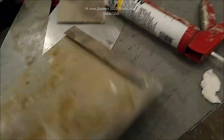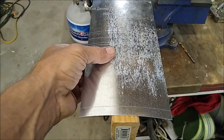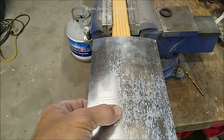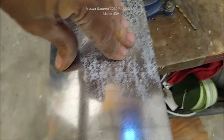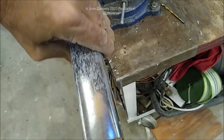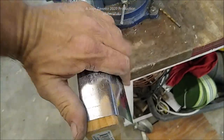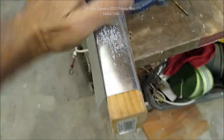Here is one of my little end caps — it's just a piece of 24-gauge sheet metal from a regular roll you buy at Lowe's or Home Depot. Here are the pre-cuts I made. For your end caps, we're just going to center it on a piece of two-by-six or two-by-four, centered, and then I'm just going to form it down with my hands like that, just keep rolling it down over the top. It doesn't have to be perfect — you're just trying to keep out large insect colonies or blowing rain. You'll caulk it when you put it in.